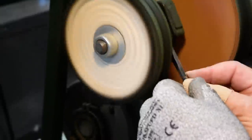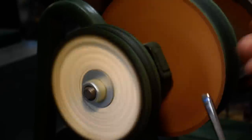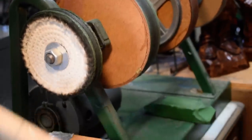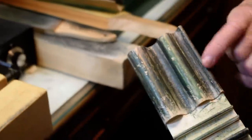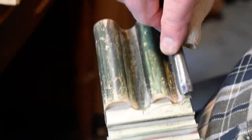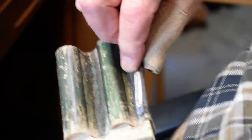There are other ways to buff your tools besides the power wheel. You have all kinds of leather strops — you can strop your tool back and forth. Same with all your gouges. You even have some that have ridges to really get in and get the inside of these tools and remove the little wire edge. This is how you remove it if you don't have access to a buffing wheel.